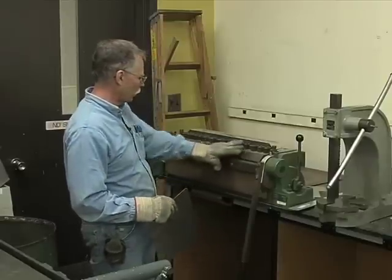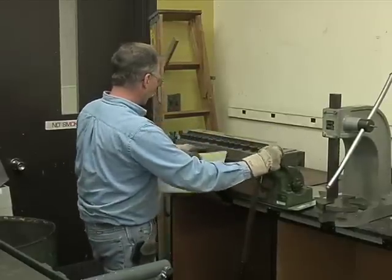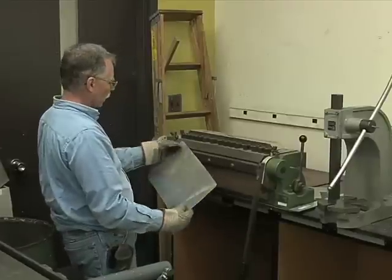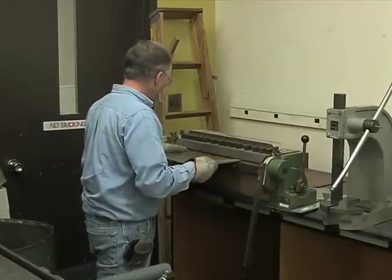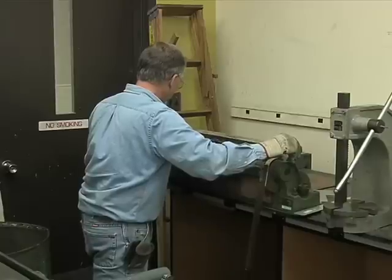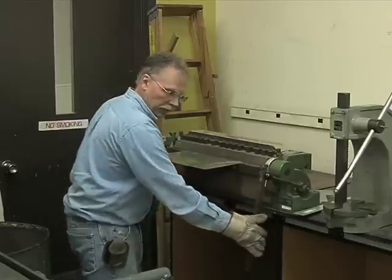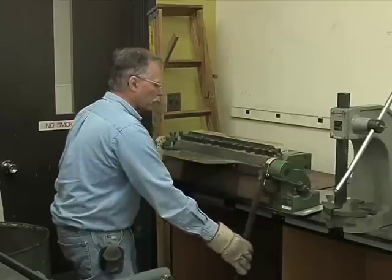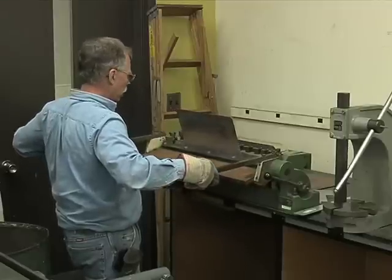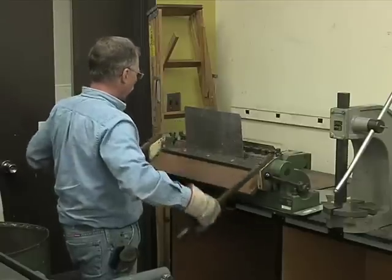And the way it works is you have this jaw here, and you have this big knob here, and this lever controls clamping and releasing that jaw. So you release the jaw, you put some marks on your sheet metal, you feed it in the machine, and you bring the jaw down. And when it grabs on your marks, you lock it down, and then these lever arms here pick this up. This is hinged, and you slowly and steadily, because the metal is being tortured right now, you bring it up to a 90-degree or 45-degree angle, and then you release.